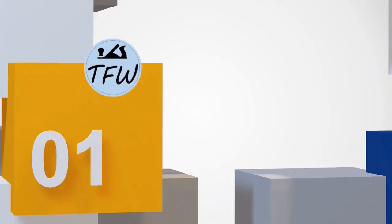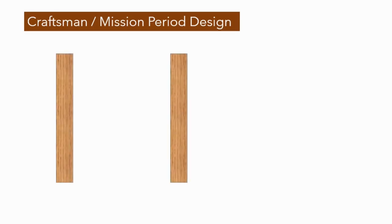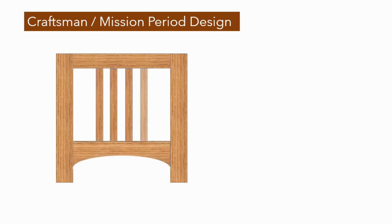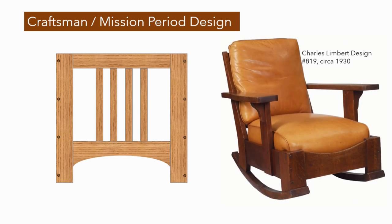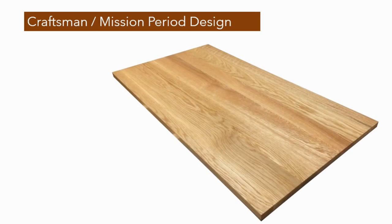So let's talk about a plan. I'm a big fan of the craftsman-style, mission-style furniture designs, and I'm looking for these legs to be beefy with four vertical staves that match the chairs on the original table. I'm also going to add some design features like an arch that closely matches the Charles Limbert rocker that I built last year, and include some visible dowels as well. Overall height is going to be 28 inches for the legs and 26 inches wide, and they're going to match the tabletop, which I'm actually going to have built for me.